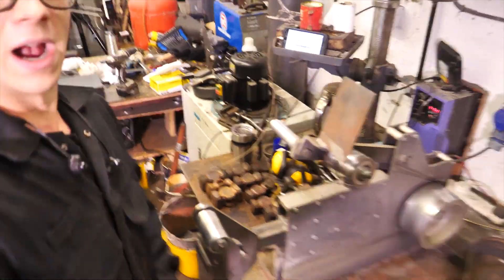What just happened is I'm here grinding and this belt is a little old. I've done a number of hammer faces with it and I'm starting to think that it's about time to go ahead and switch it out. And one of the things that terrifies me the most is belts exploding. This happens because you use the belt really hard — eventually the seam goes, it busts, it explodes. Hopefully you change belts before that happens, and usually you do. I'm running it so hard the belt just exploded and it scared the daylights out of me. I'm here, stood at the grinder, grinding away.